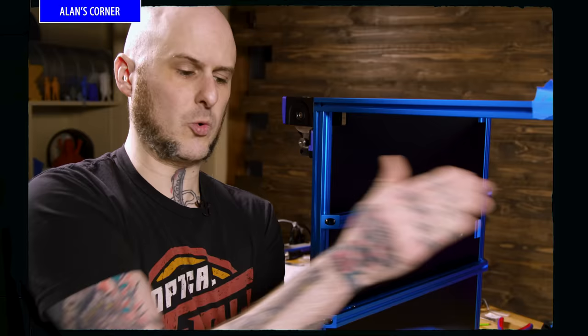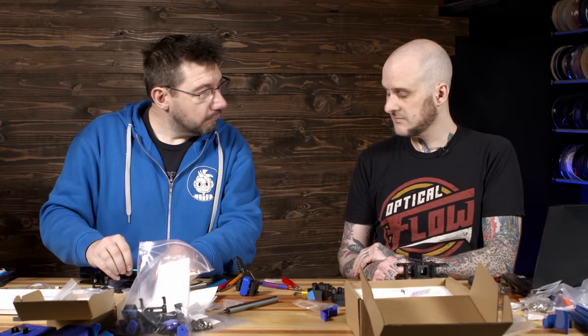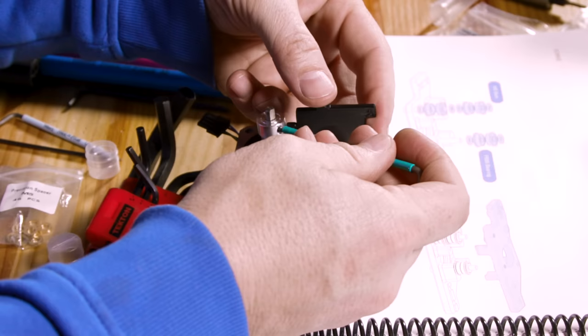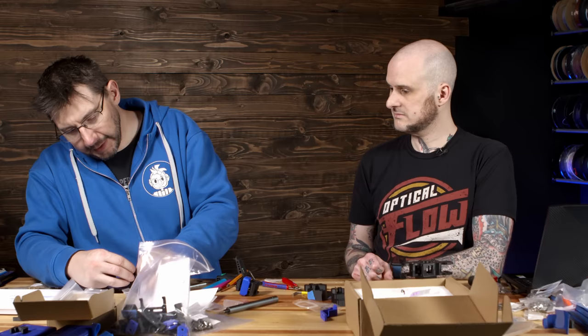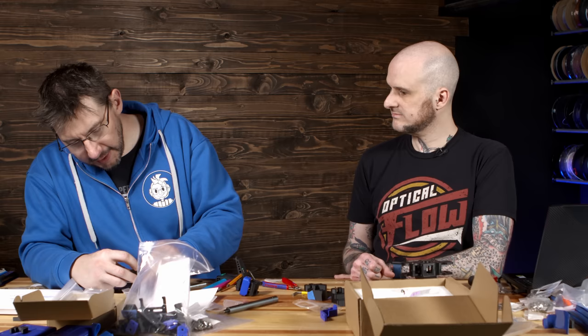At this point, I'm putting on a pulley on a motor, and there's this cool little doohickey gizmo thing that kind of lets you do the proper spacing depending on what the motor's function is. I just completed doing the same thing on the other side. So we're assembling the A and B motors, where the XY of the core XY. That is one of the cool things about this machine. People get to learn more because there are X and Y axes and a Z axes, but the motors aren't responsible for singular movements within the X and the Y, because the A motor moves diagonal in A and B, or in X and Y, and the B motor moves diagonal. So that's why we can't call them X and Y.